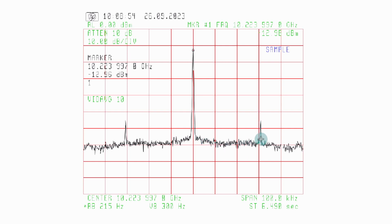There's only one spur here in the plus minus 50 kilohertz. They're actually at 30 kilohertz apart from our carrier. These are more than 40 dB down, so they shouldn't bother us at all, especially because we're doing narrow band communications in the 0 to 5, 0 to 6 kilohertz bandwidth. So these are too far to bother us. They may not bother us anyway, other than if we look at a waterfall, just a small line showing on either side of the waterfall. So it won't really bother us. I'm pretty convinced of that.